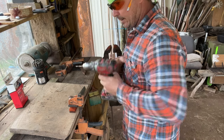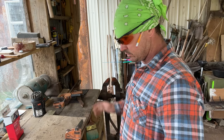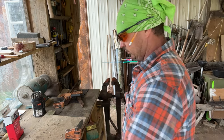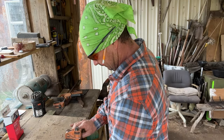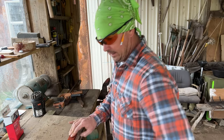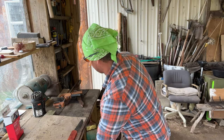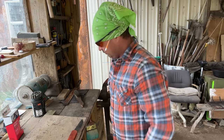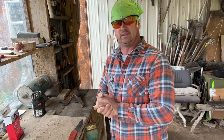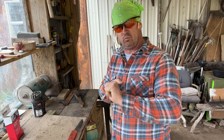When you're drilling these out through already hardened steel — this has not been annealed at all, this is just a piece of finished steel — drill slow. I've got a good drill bit for hard metal. I bought some the other day — carbide bits. Anyway, I have put knives together and never put any glue or epoxy on the pin into handles, but I quit doing that because pinned handles — those pins will split wood. When we've got good epoxy, that pin is there for looks and to hold it in place. Just in case something happens to that glue or epoxy, it won't slip out. It's not there to hold that handle secure and tight — that epoxy, that's its job.